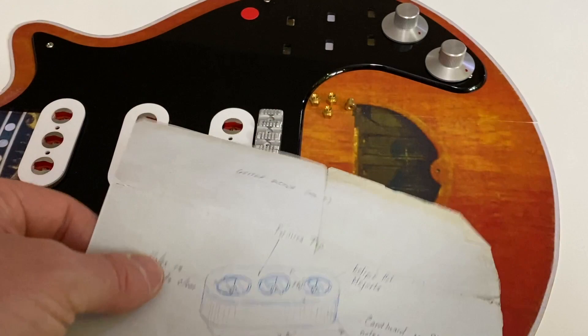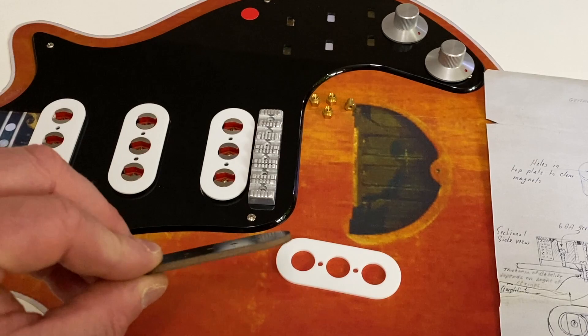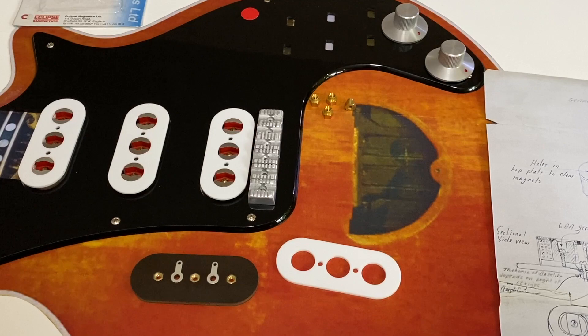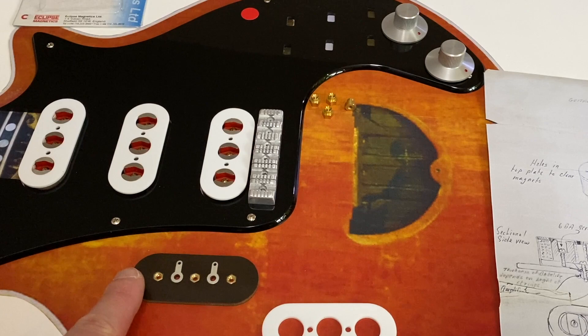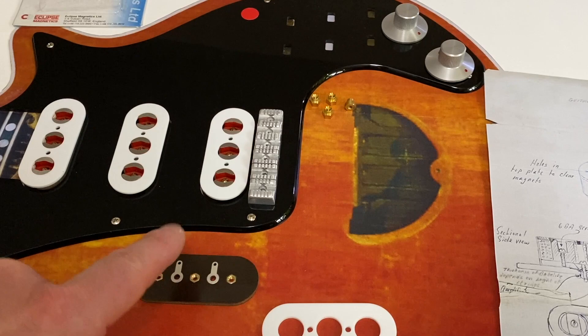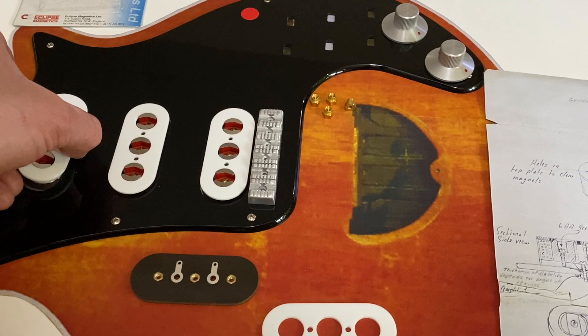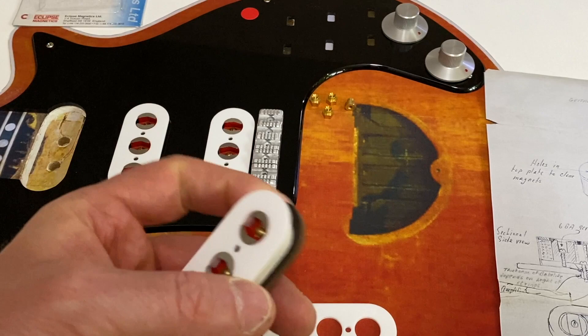This sketch shows that this is design number three, and the design consists of a Paxilin base, three cylindrical button magnets of this type. They measure a half inch diameter by three-eighth inch height, and it's got a white melamine top cover. Each of the pickups measures two and five-eighths inches wide by one and a sixteenth inch by half an inch high. The coil itself is wound onto a cardboard former which fits around the magnets, and the two ends of the coil pass through the base and are attached to two tinned brass solder tags which fit flush into the base.